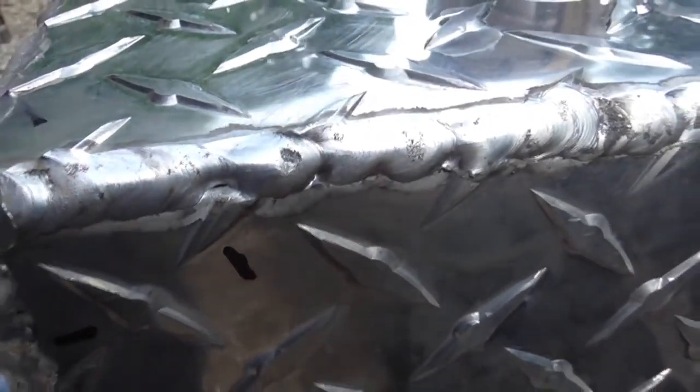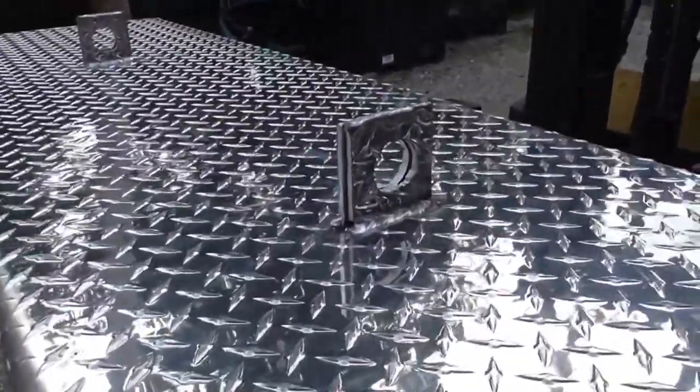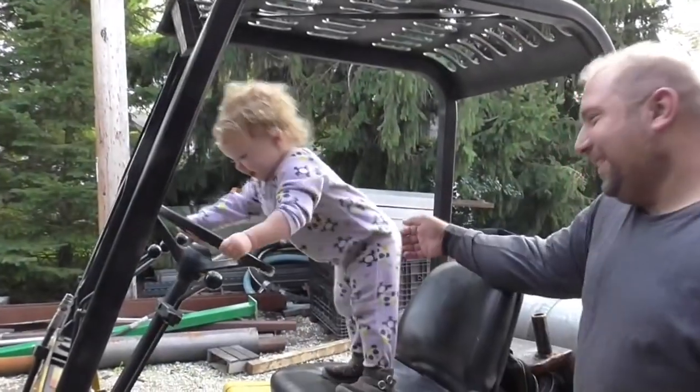My little helper and I are going to check it out. Right here is incomplete fusion, up here is a legitimate pinhole - not just peppering in the weld - incomplete fusion there, and a whole bunch more on the bottom. We're going to use a TIG welder to fix everything, then make new lifting lugs designed on the computer, CNC cut, nice and big for a big strap. That'll look nice and appealing with no sharp edges.